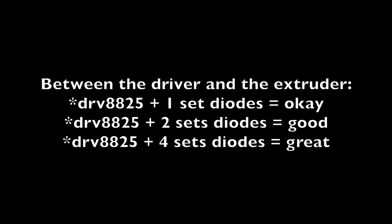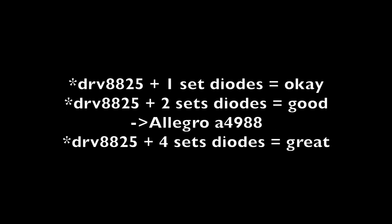You get the most bang for the buck between one and two sets. So one of the eight-diode boards would probably be okay, or if you wanted to put a set of the four-diode boards after the eight-diode boards that would give you three sets altogether. If I had to rank just the Allegro A4988 boards, I'd put them between the two-sets boards and the four-sets boards, so you might be better off just sticking with those if you can deal with the lower torque from the lower current. But if you need to use the DRV8825s for the higher current and the better stepper resolution, the boards actually work great. And if you don't mind a couple extra things dangling off your lead wires in your printer, I say go for it.